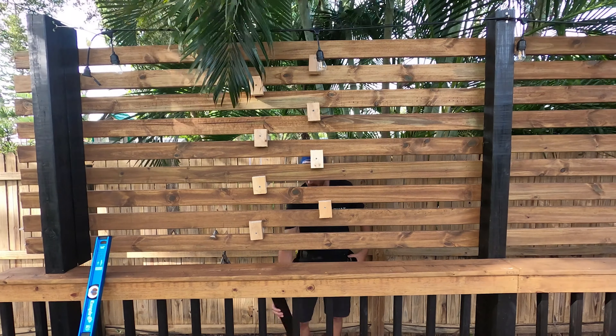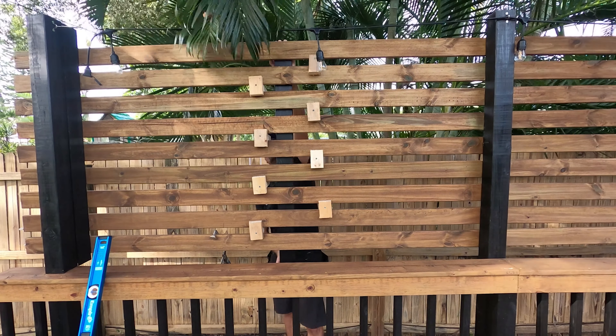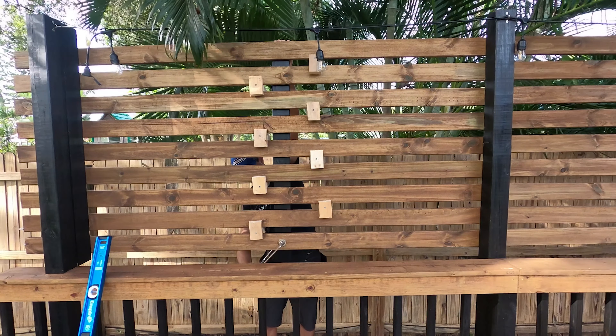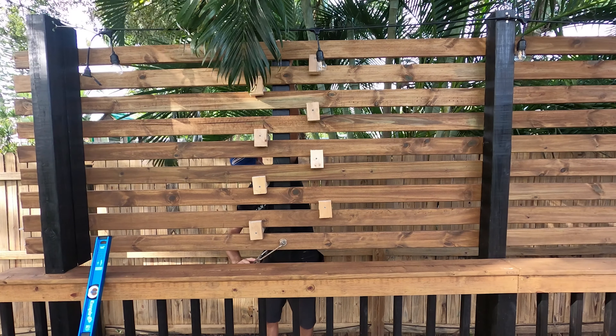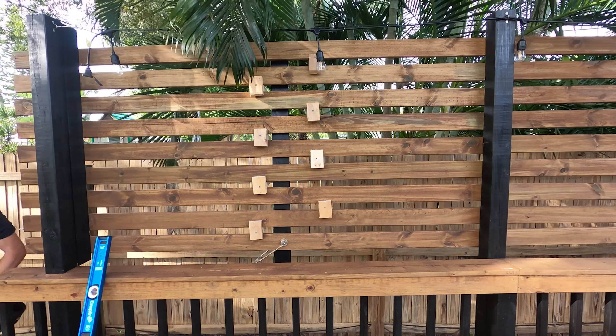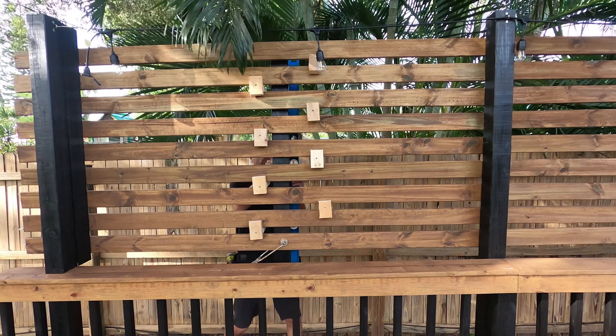What we've done in this build is cut a two-by-four to the right height of the fence slat area. You can see me install it here — we clamp it so it doesn't extend past the top or the bottom. I've inserted the spacer blocks every other picket, left and right, left and right, so that the spacing is maintained all the way across and up with no sag in the middle.